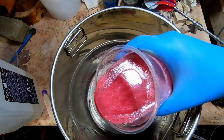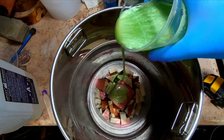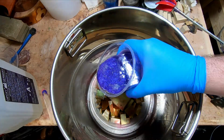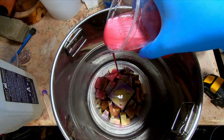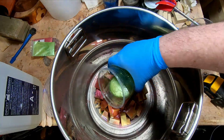I placed the casting into the stainless steel bucket that came with the pressure pot. As you can see, it conveniently catches the overspill of resin and keeps the pot clean. Then I added the now very hot resin, 1 bit at a time. The purple was still relatively cool. The 3 batches filled the mould to the top, and to stop the offcuts floating off the bottom, I added a plastic lid with some weight on top.